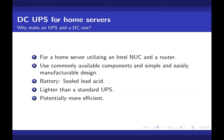There are a lot of off-the-shelf UPS options, but we added an additional objective: how do we use the most commonly available components? We could use SMD components and really high-end battery management chips, but those wouldn't be available in a common store. In a common store you'd find through-hole resistors, the ATmega 328P microcontroller, and a very limited selection of components. So that was one of our objectives — to use the most commonly available components and make the circuit design simple, to the point where we could hand-assemble it on a perfboard.